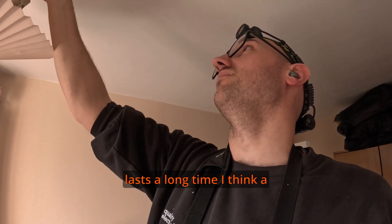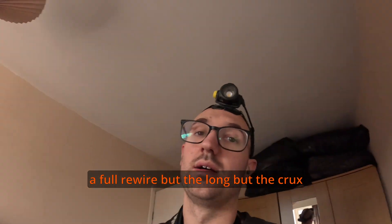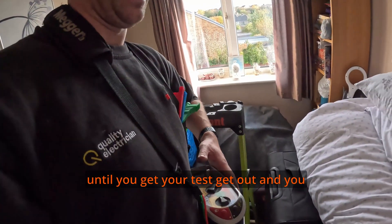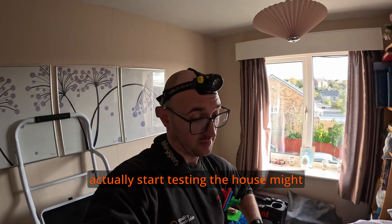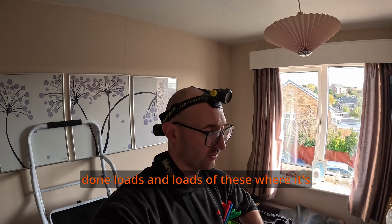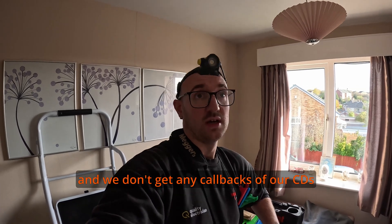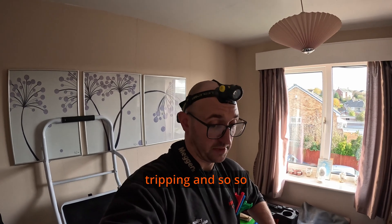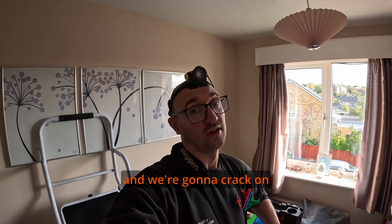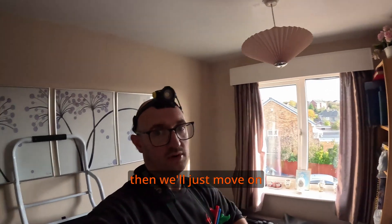It's twin and earth so it does last a long time. A lot of people would have probably written this installation off and said you need a full rewire. But the crux of it is you just never know until you actually start testing. The house might be fine, the installation might be fine — get a new board and make it nice and safe, and you're not really going to have problems. I've done loads of these where it's been all old wiring and we've swapped the fuse board after the EICR and remedial works, and we don't get any callbacks with RCDs tripping. It just goes to show you can't always write an installation off because it's old.